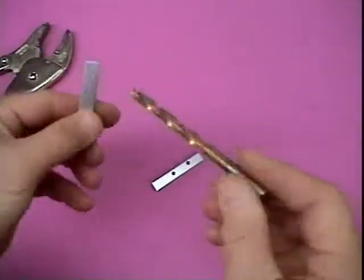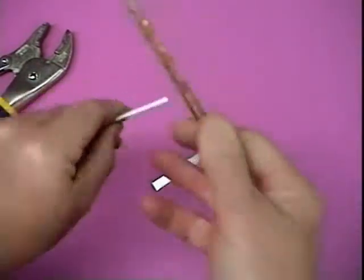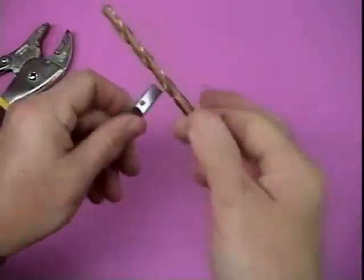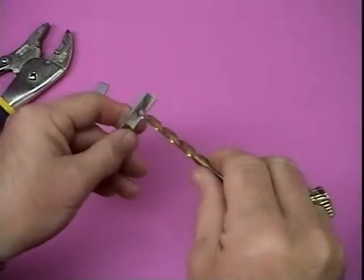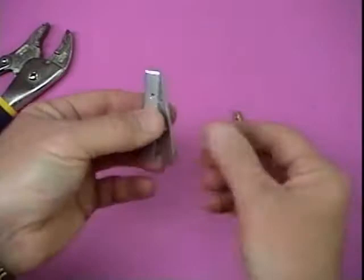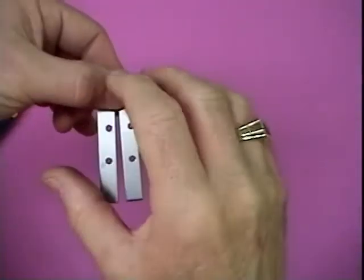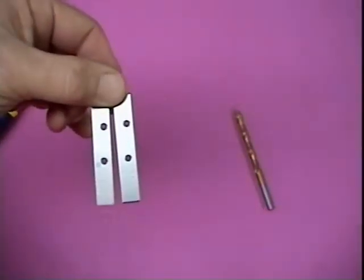Anyway, this is a slightly oversized drill, and what I do is just break the edge. This is just because I'm trying to do this as professionally as possible. It's these little tips: anytime I drill a hole in aluminum, I like to break that edge. No special reason, just because we're proud of what we do. Now we're ready to install everything, tighten the blind nuts, and get the blind nuts permanently installed. That's the next step.